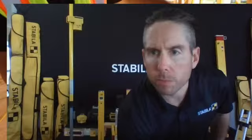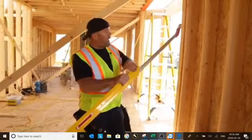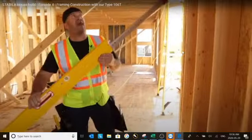Two, I'm going to extend my plate level. As you can see, we have numbers on both sides. What this allows me to do is set the proper height. Place the plate, we're at 9'2". I'm going to lock it in at 9'2". And as you lock it, what it does, it puts the proper camber on the stand-up. This way, it's perfectly aligned.